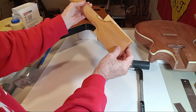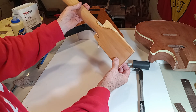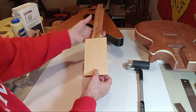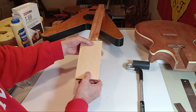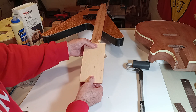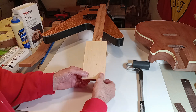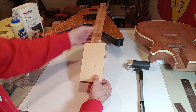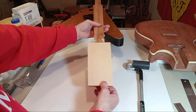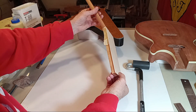I'm still going to put a caul on it and hold it down. It's still sliding around — that's the beauty of the epoxy. I could go make a pot of coffee, come back 10 minutes later, and still push this around. If you're working with a veneer, just sit here for about 10 or 15 minutes with your pencil marks or center line and move it around until you're certain you're staying on center. Hold it by hand and within about 20 to 30 minutes it'll start setting and then you'll know you've got the job right.